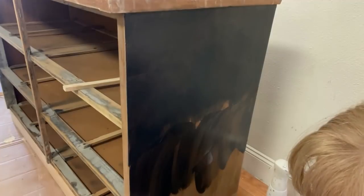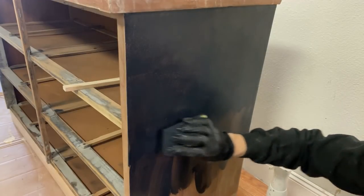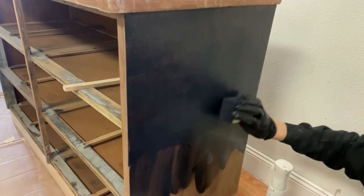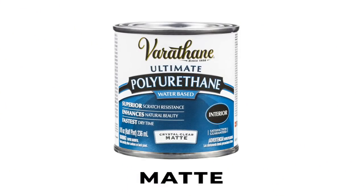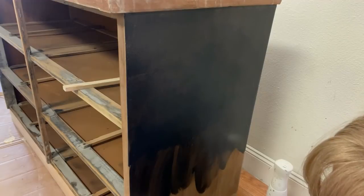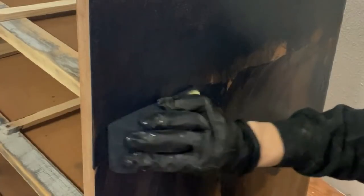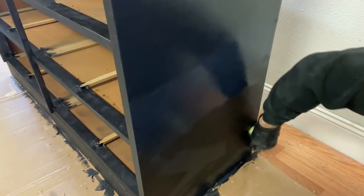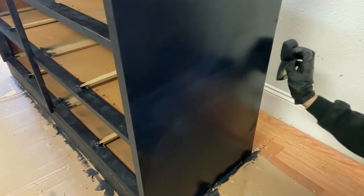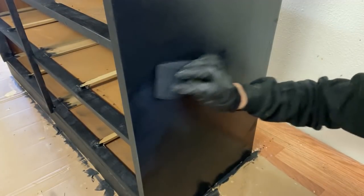I have two all-in-one paint recipes — one uses latex paint with primer and the other is for latex paint without primer. Both recipes are on my blog and the link will be in the description. I mixed up the paint using flat water-based polyurethane and stirred it very well at the beginning and frequently as I painted. I wanted a very smooth finish, so I used a car washing sponge to apply it with a dabbing motion. It always looks bad after the first coat, but the second coat covered it well, resulting in a smooth finish. I didn't even have to sand in between coats — since it had primer, paint, and sealer in one, I could skip those steps as well as all the sanding in between.